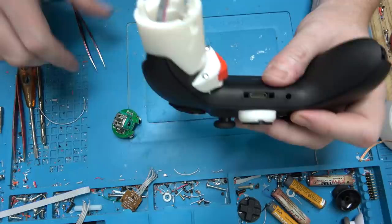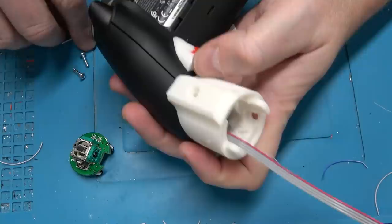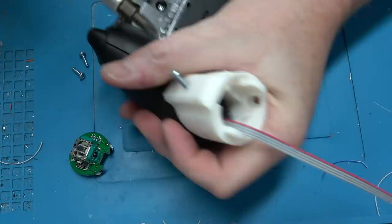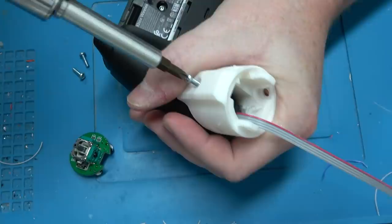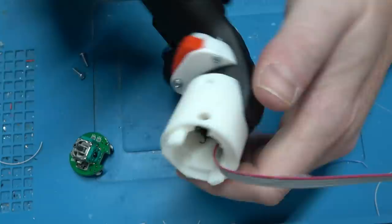When this goes in here, those holes allow you access to the pots. I'm sure if people aren't clean these holes will collect grime and dirt, but your cleanliness is your problem. Hot glue just to get it into position. Oh crap — I forgot to put the things on! I got so wrapped up in my It's a Wonderful Life fan fiction I just forgot a simple and obvious step. Now that it's been positioned with hot glue, I'm going to go through one by one, drill a hole, and drive a screw to hold it to the controller. There are three screws so we have three contact points, which is good because this shaft takes a lot of abuse.